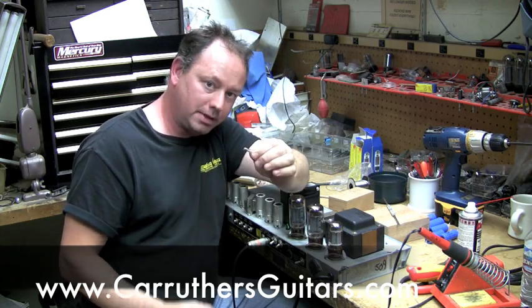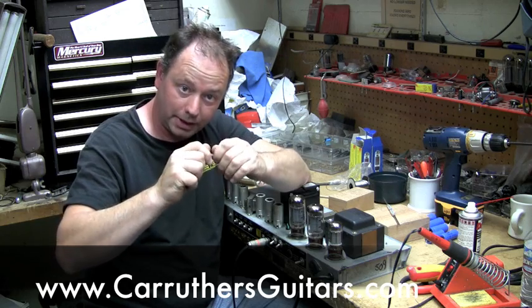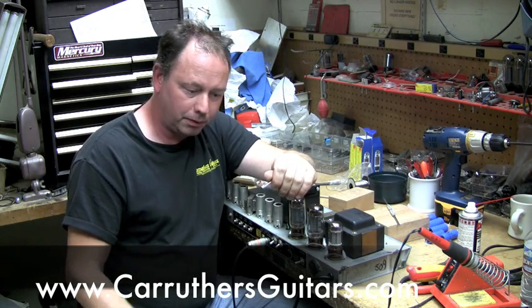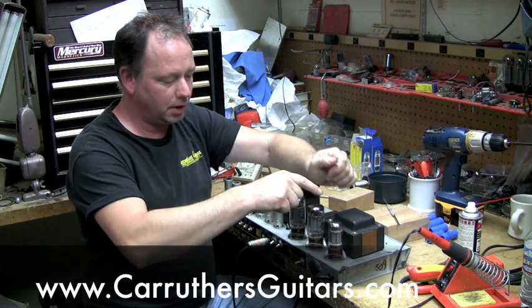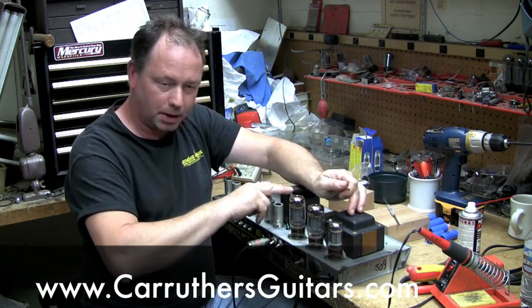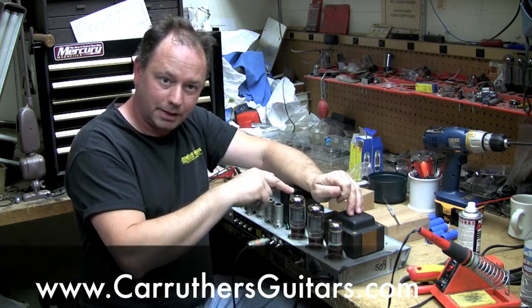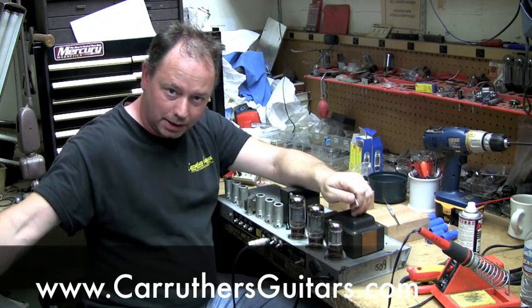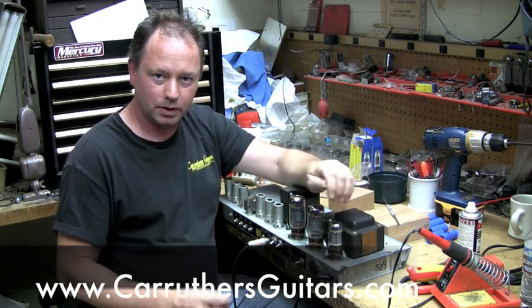If people put a solid piece of metal in there, or sometimes they stuff aluminum foil, roll it up and put it in here, and then run current through that, the aluminum foil doesn't have the reactivity these fuses have. So whatever is smoldering and burning in here, if the foil goes first and burns out, then your amp will set a fire, or at least give you a lot of smoke. If the amp is stronger than what the wall wiring is in the club, then you might have a little smoldering club thing going on. So you don't want to do that.